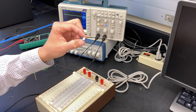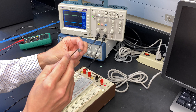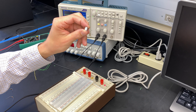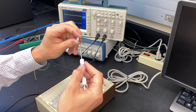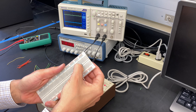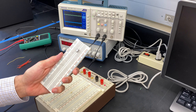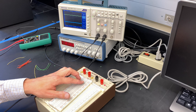I'm going to show you how to use a 741 op amp to create an inverting amplifier circuit. These op amps have eight pins, four on each side. They also have a little dot on the top left corner indicating pin number one. Going down: one, two, three, four; moving to the other side and going up: five, six, seven, eight. When putting it into a breadboard, slide it in so that the legs straddle the slot, giving you access to all eight pins on either side without connecting pins to one another.